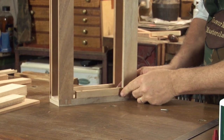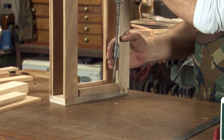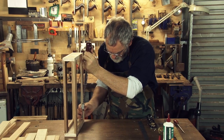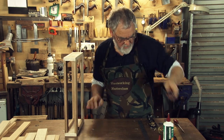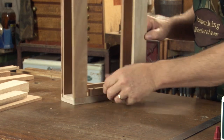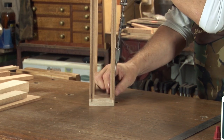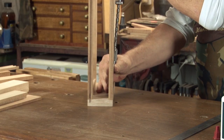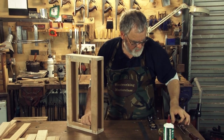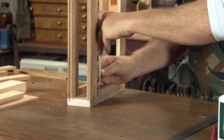So there's a bit of glue there and there. Then we put the screw in. And the other one. But no glue on this end - it's free to move. And just make sure that it lines up nicely with the edge. And as all true craftsmen do, especially with slotted screws, you dress the screws so they're all facing the same way.